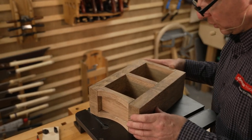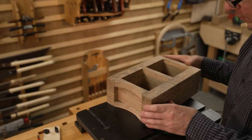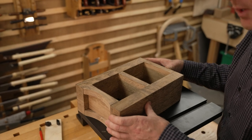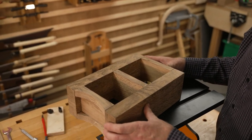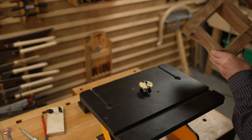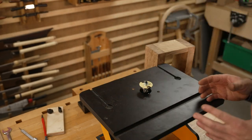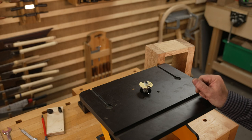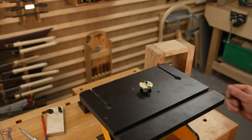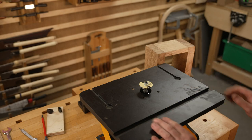We can come in. Now we've got to look at direction of where we're going to cut round with this. All right, we've got to do one, then we're going to do the other. Got to look at the drawing, just check we're doing the right ones, okay? So we're going to cover the cutter. Can't really have any extraction with this, so yes, it might be a bit dusty, so goggles, earmuffs are really important. Dust mask might be good for this. Right, so up to there.